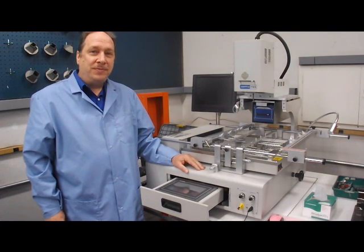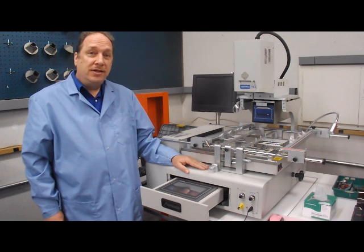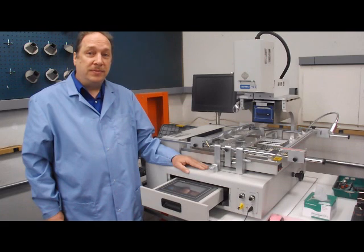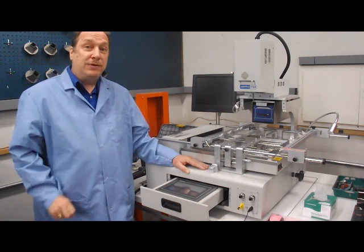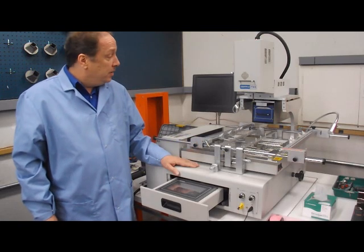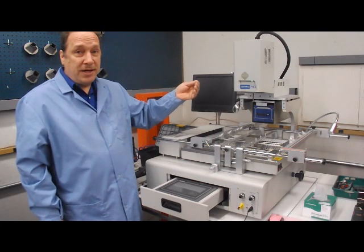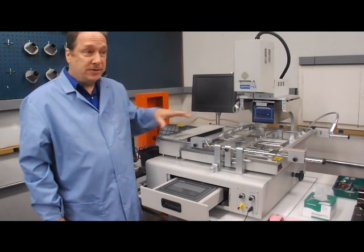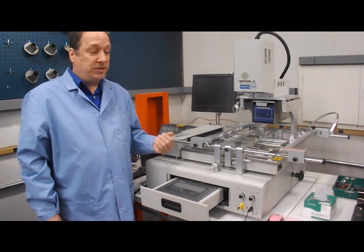So we move back to my shop now. Today I want to show you the ShuttleStar SV550. The model's been out for quite a while, and recently they've also come out with the SV560, which has a higher resolution system. I'm going to tell you why I like these systems. I've used the higher end machines for over 15 years, and I started using these and just fell in love with them. This machine has top and bottom hot air and infrared perimeter heaters. It allows very even heating, even on the largest boards.